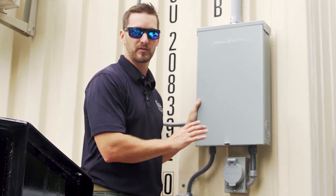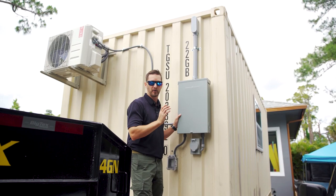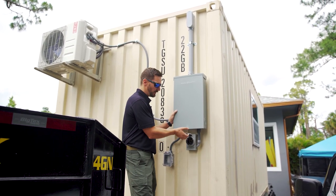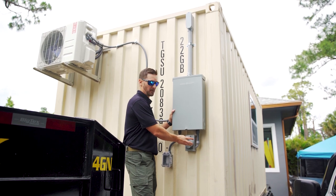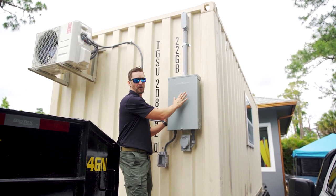Our containers are designed to be able to go to virtually any RV park and plug in water, sewer, and electric, exactly as any RV. So we have a 50-amp RV plug mounted here — and there's ants in there — that's going to be our power inlet connected to a 50-amp main breaker inside of our panel.